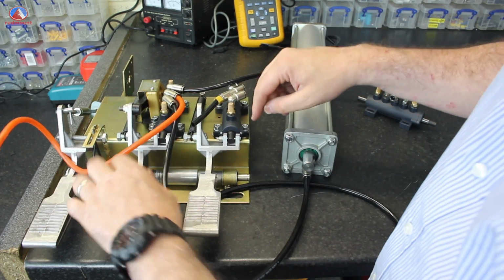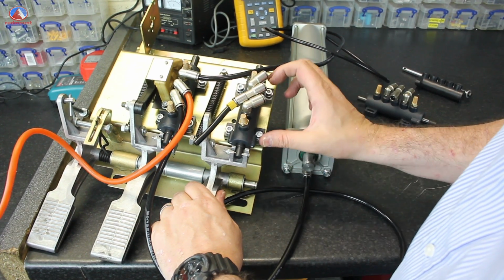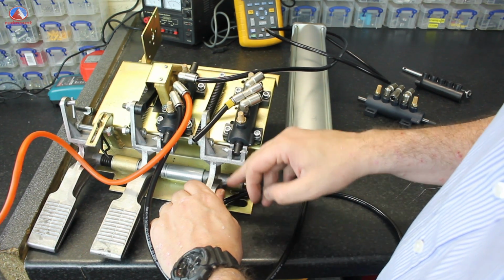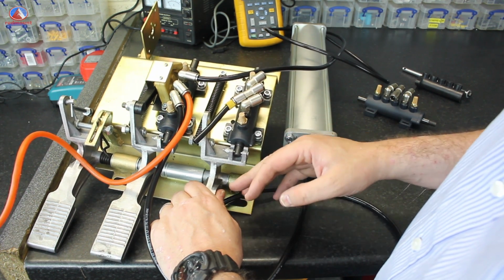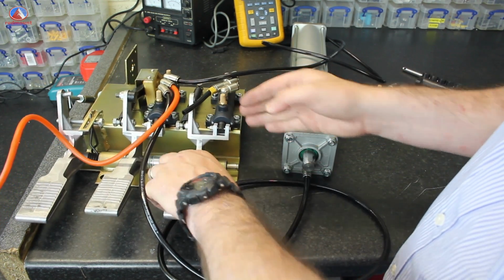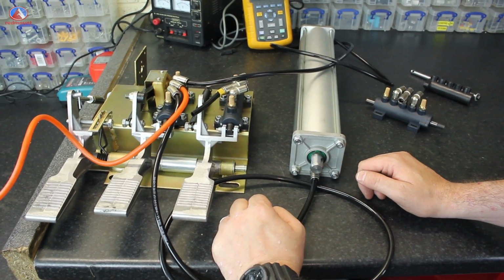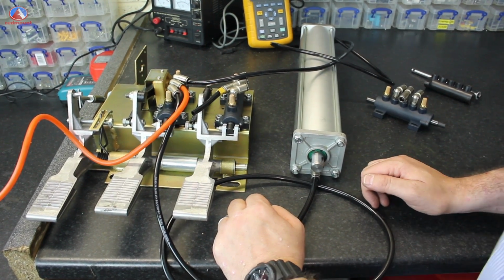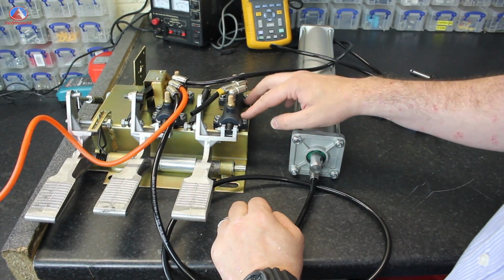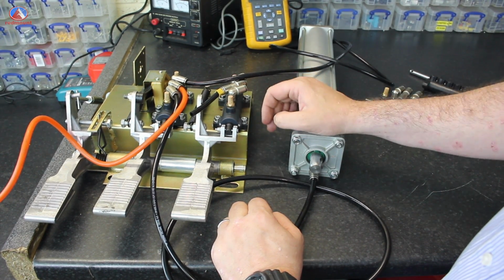So what you need to do is, I'll show you on this side here, loosen these 4 bolts, move this up and down to the point where you're happy with the biting point. It's actually biting down at the very bottom, or wherever you want it to bite. Tighten these up again. Over time they might get loose. Normally there's Loctite on them. This shouldn't get loose, but if you find they do, I'm just after kicking the camera, sorry about that. If you find they do, then that's the fix for that. Just loosen these, adjust the whole manifold slightly, tighten them back up again.